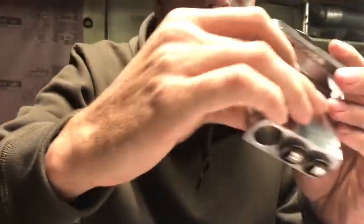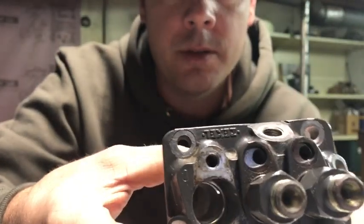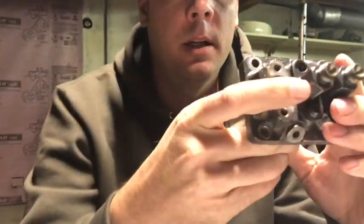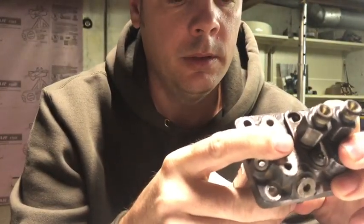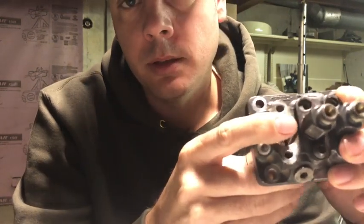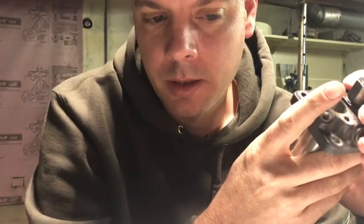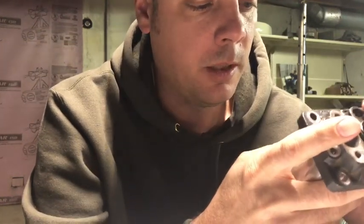Hey guys, I just wanted to share a little information on working on an injection pump for a 1105 Kubota. It's a Zexel injection pump. I had a part and cleaned it — I've got two of the barrels and plungers and all the assemblies, the rollers, everything in. I wanted to go over some of the things you can do and maybe how to put it back together so you have a basic working concept.